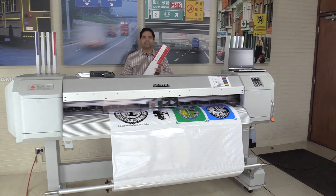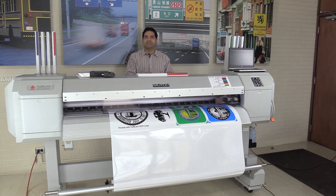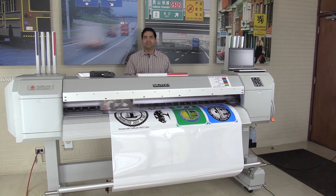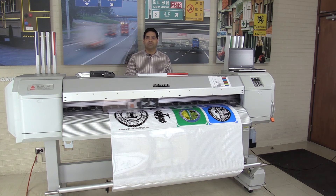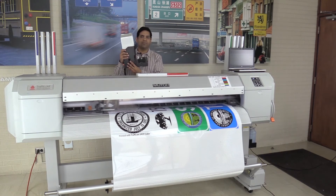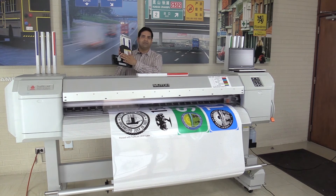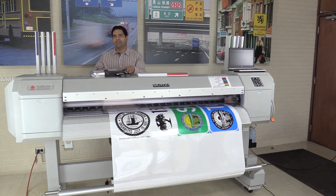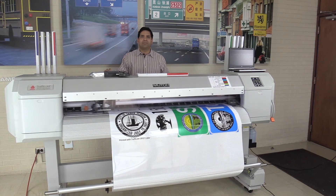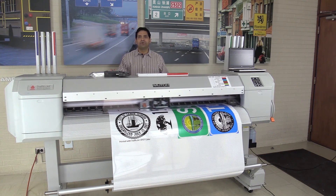The inks are available in two sizes. You have the 440 ml — about half a liter — and depending on the type of signs you're printing, from full coverage like street signs to low coverage like speed limit signs, you should get about 600 square feet, roughly one roll of sheeting. You also have the 950 ml option, about a liter of ink in a bag loaded via an adapter directly into the printer bay. With this one-liter bag you should be able to print about 1,200 to 1,300 square feet, worth about two rolls of sheeting.